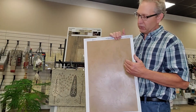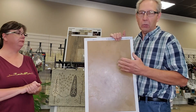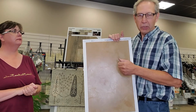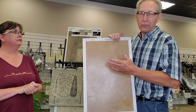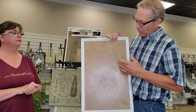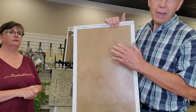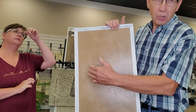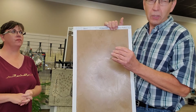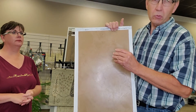It's a traditional plaster in the sense that you trowel it on. When it's on the finished coat, you trowel it harder and press harder — you burnish it. The burnishing brings out the shine and brings out the variation in the colors. Where the darker colors are, that is where the high points are in the previous coats, so it puts more pressure on those spots.